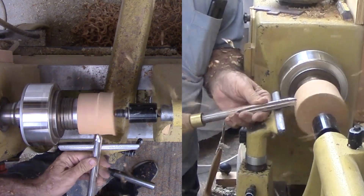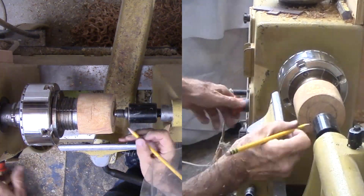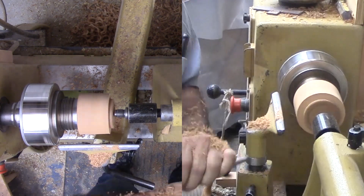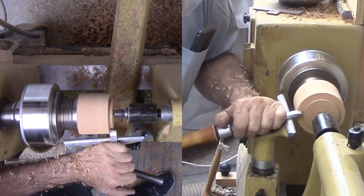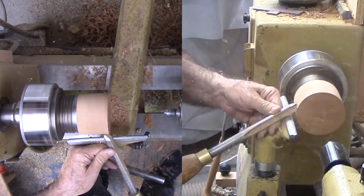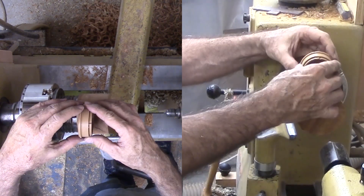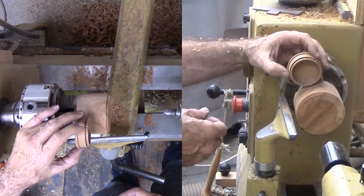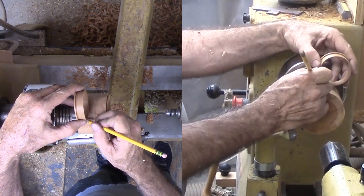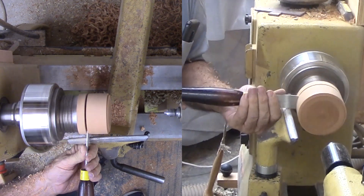It is a collection of weird shapes, beautiful only to a woodcarver. I cut off a section about four by four by three. Live center pressure against closed chuck jaws should be sufficient for a while. I rough round it and cut a tenon for a solid mount. Once I have a tenon, I flip it around to mount it securely into the jaws. After cutting yet another shallow tenon on the other end, I measure and mark for where I can split the wood. Now I can part the wood in two and clean up the end. Off camera, I cut a shallow mortise to fit the bottom portion of my insert.